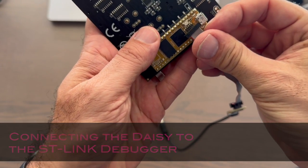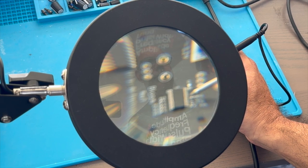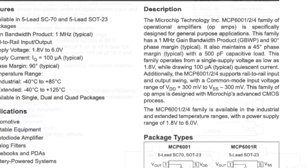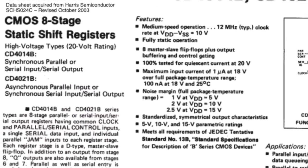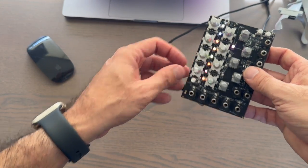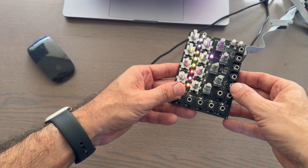This is going to take some detective work — some trial and error and good old-fashioned inspection of the circuit board. We came across a couple of multiplexers and LED controllers in between the components and the Daisy Seed that we had to figure out, but nothing a little trial and error and some poking around in the circuitry couldn't conquer. We have wrested control of the Bloom — we can now control all the inputs and outputs, read from the knobs, and detect the clicks of the encoders. I've created a header file that will allow anyone who wants to write code for the Qubit Bloom, and the people at Qubit have graciously allowed me to share this. It's available on my GitHub, and I'm also making the code for my firmware completely open source.